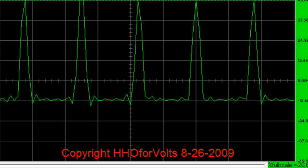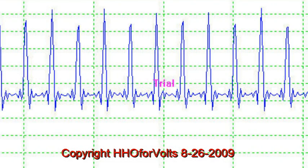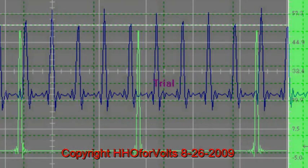Is the circuit optimized? I wouldn't think it's an optimized circuit at all, but I wanted to duplicate hers. Up is positive and down is negative, so we're looking at positive-going pulses and a short duty cycle. There's no invert switch turned on in the software — those are positive spikes. There's some ringing at the bottom, which could be due to the sound card, but the sound card is not going to make mistakes in the duty cycle.